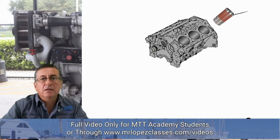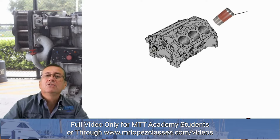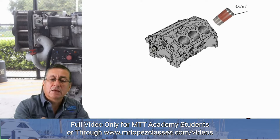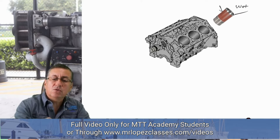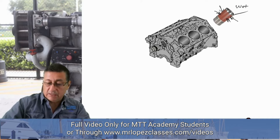For that reason, 90% or more of marine diesel engines have wet liners. Those liners are wet liners because the coolant surrounds the liner in order to keep the temperature lower. This is an excellent design advantage.